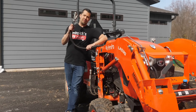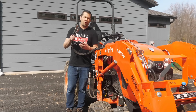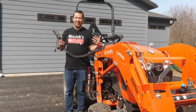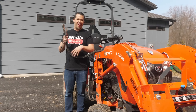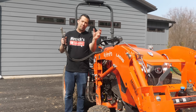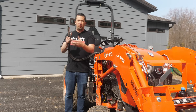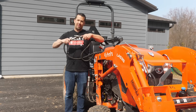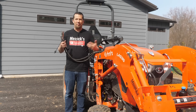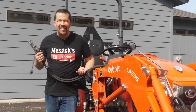I'm not the slightest bit surprised that I'm having trouble with these things today. When you're dealing with a hydraulic coupler, it's quite a lot different than an airline. If you've used an air chuck before, they're very easy to connect. When you've got a little bit of pressure in those airlines, it's pretty easy to overcome that air pressure — you can always connect those couplers together and compress that air a little bit more. Fluids, though, are uncompressible.